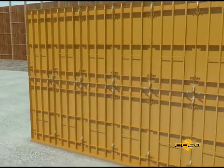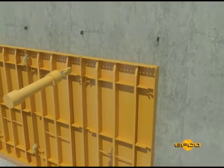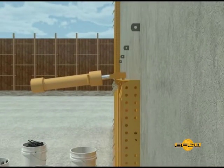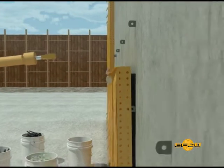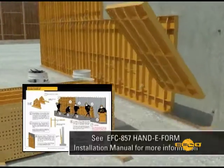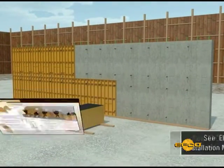Step 4. Next, remove the panels. If handy form panels become difficult to remove from the wall after the pins and plate clamps have been removed, an EFCO plate puller is available to assist in this operation. Simply place the pin of the plate puller in the top flange of the panel and use the hammering action to remove the panel. Do not permit the throwing or dropping of form panels during the stripping operation. This could result in personal injury and damage to the panels.